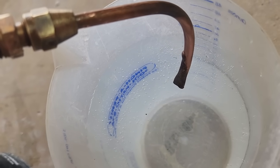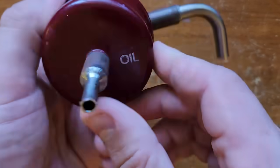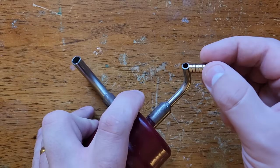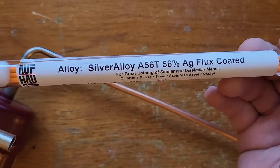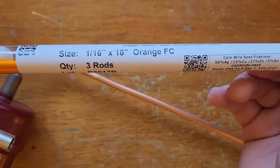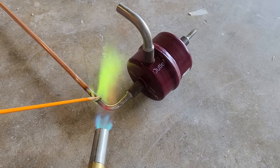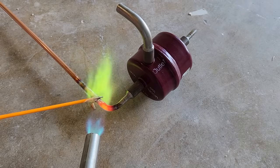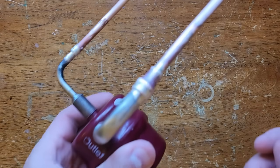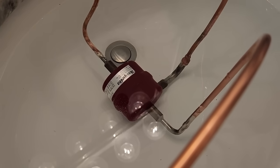I guess my technique is working even if it's not that pretty. That was a phosphor copper alloy for brazing copper to copper or copper to brass, but the oil separator I got has stainless steel tubing coming off it, so to braze that to copper I'll need SSF 56, which is a silver solder with some sort of fluorine-based flux. Just FYI, if you're going to use this, the flux fumes will make you horrendously sick, so make sure you do this outside and wear a respirator and eye protection. The end result is a pretty nice clean joint between the copper and stainless, and I didn't see any bubbles when I pressurized the separator and submerged it in my bathroom sink.